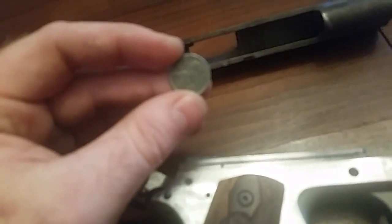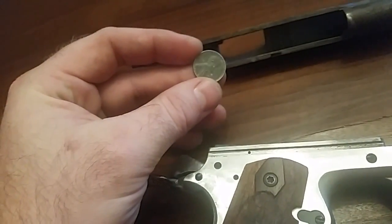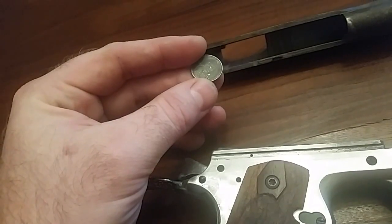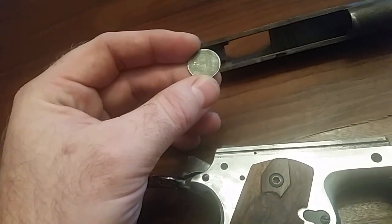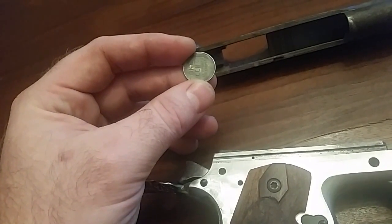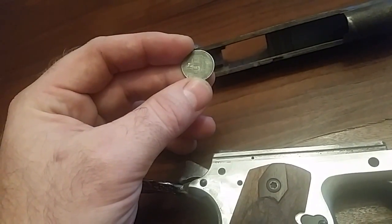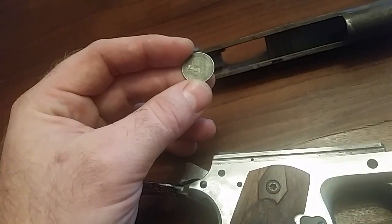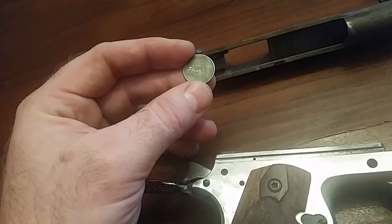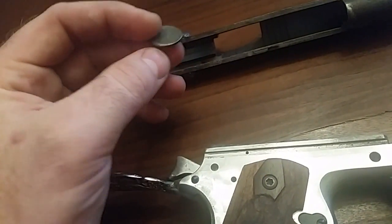This is one of a roll of these steel pennies I got. It looks like the biggest issue on doing these is going to be stripping the zinc coating off them. Nobody wants to weld zinc for a good reason. So I got to figure out how to chemically strip that off. I think just a basic acid should probably do it with some scrubbing. Could probably also burn it off, but I don't want to be around that. Zinc fumes are pretty nasty.